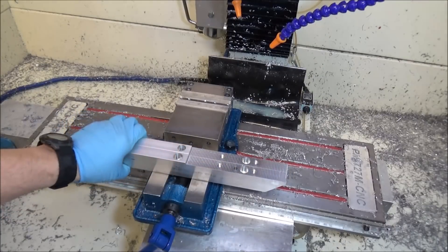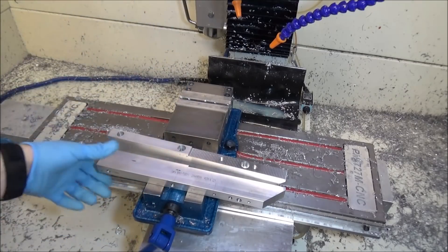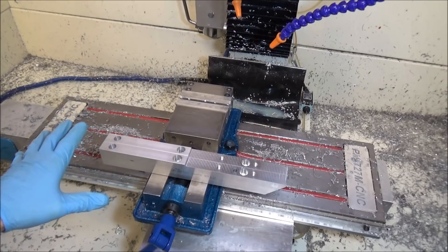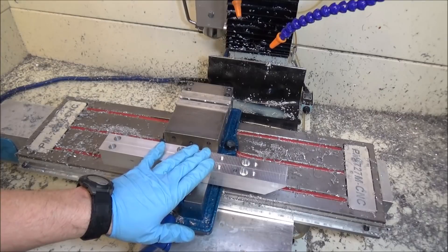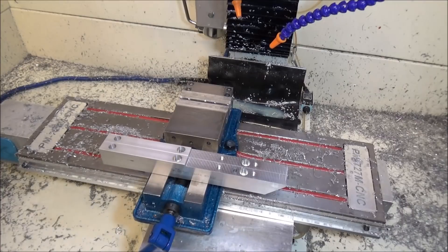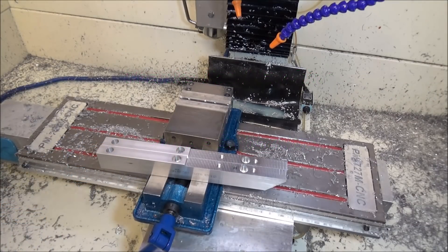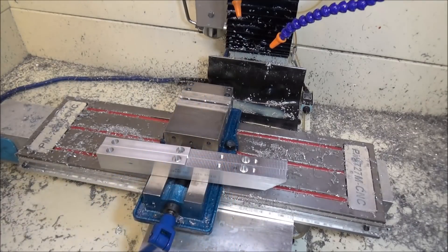Now that I have these risers made, I'm not going to do anything fancy - I'm not going to come back and fly cut these. It's all going to be mechanical stuff that's not really going to be seen; there'll be a cover over all this when I'm finished. So it doesn't need to be too pretty, it's just going to be structural. Next, in the next video, I'll machine out the motor mount and then we can get this mounted up and hopefully get the belt drive running. Stay tuned for that video. Thanks for watching guys - please subscribe to the YouTube channel. If you have any suggestions or questions please feel free to comment, thumbs up if you like the video, and most importantly, be safe.